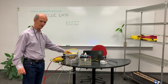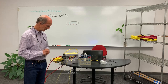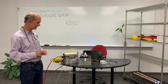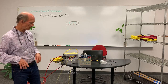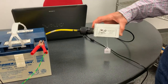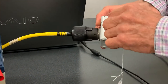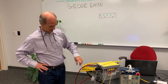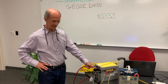Okay, so we are now connected. We have the receiver out in the field, our magnetic sensors are connected, and we've only got one dipole connected here — we will actually connect four dipoles when we get into the field. We have all of the ethernet connection, and now we want to power up the box simply by pushing the enable power button. You will see two flashing lights on the box: one indicates power, and the other indicates that the ethernet connection is working.